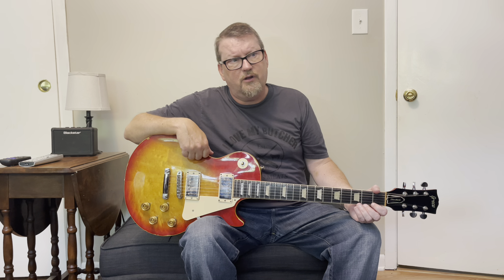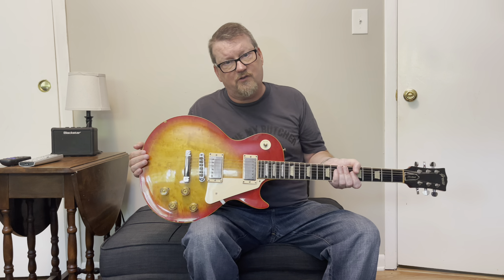Once I took the wires off and read them, one was coming in a little over 12k and the other was coming in at about 6.8k. It's a three-conductor ground and two-conductor pickup, and I noticed both were soldered together — that's not how it should be for a proper humbucker. One of them needs to be floating; you just tape it off. I immediately deduced that pickup was bad and went to my stock of others.